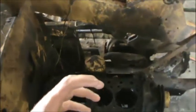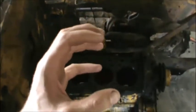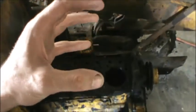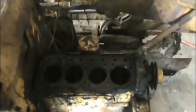It'll sit there on that piston until it completely gets junk and rust and gook all in the piston rings. And rings are kind of like springs. They compress and they open up, and they compress and open up. Well, it locks them in whatever position they were. So all of a sudden you have no compression. So that's what this thing had, man.